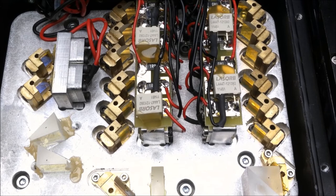You might be thinking, okay, why do you need 12 red laser diodes? Seems like a lot of laser diodes. Yes, it is. Now, in applications like this, if you want a very tight beam, it's very much preferred to use low-powered, what's often referred to as single mode, instead of multi-mode laser diodes. They have a much nicer form factor, and the beam is a lot thinner. So the beams don't spread out nearly as much when they're traveling.